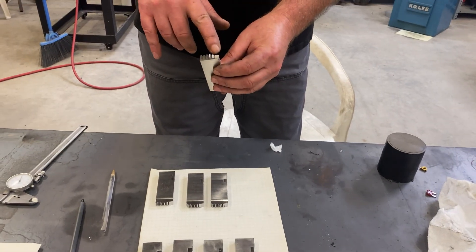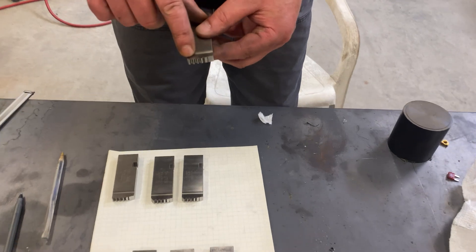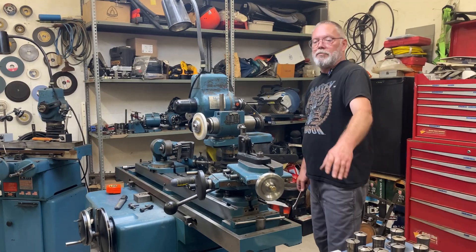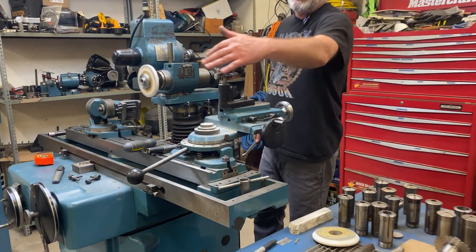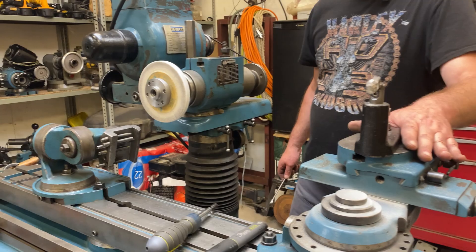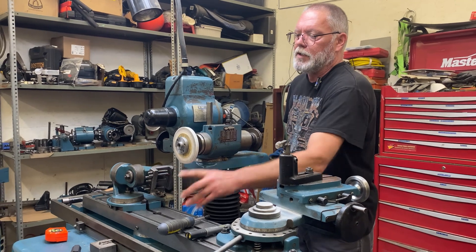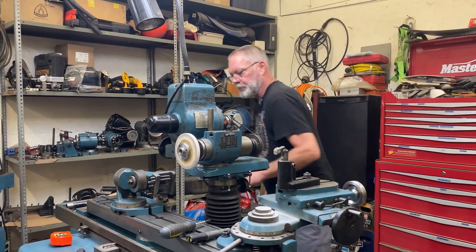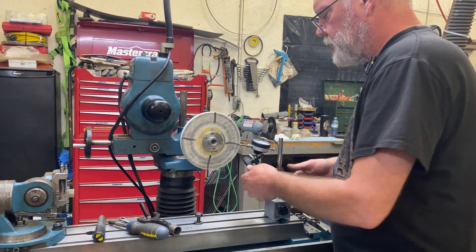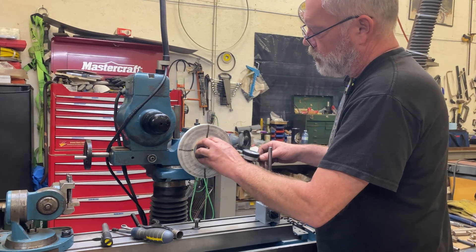That's setup number one done on all these tools. Now I'm going to set up to remove the damage on the face and clean it up. First I'm going to vacuum off my radius grinding fixture - you can see it's just covered with grinding wheel grit. I'm going to vacuum all that up, put this fixture away, then readjust my universal work holding fixture and put a different wheel on in order to grind that face. I'm dialing my wheel in now so that when I dress it I remove as little wheel as possible, so I'm not wasting wheel.